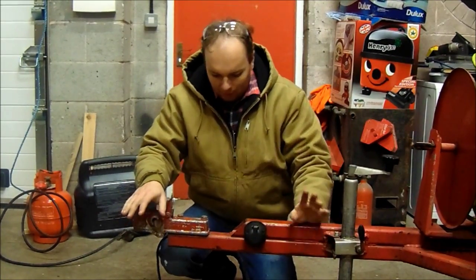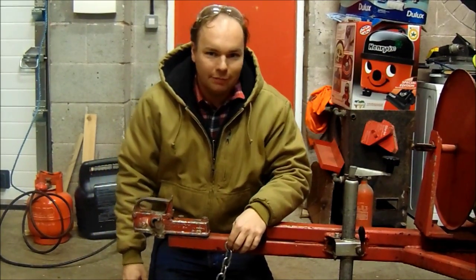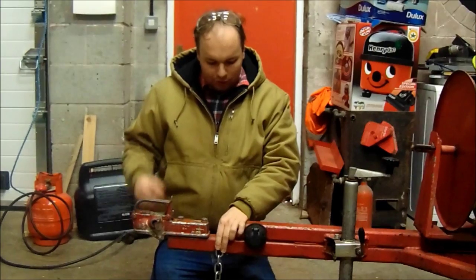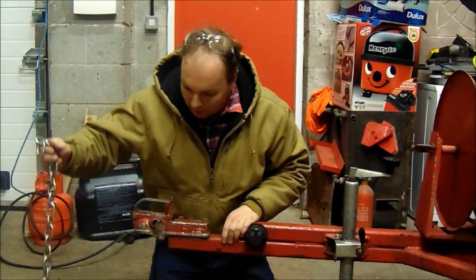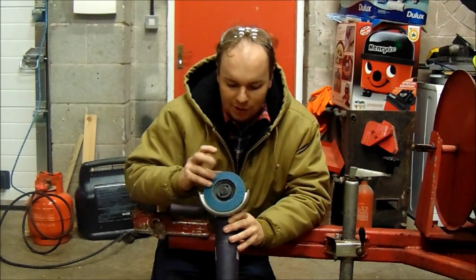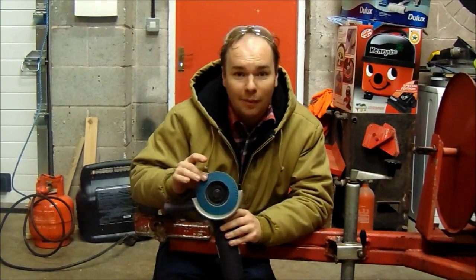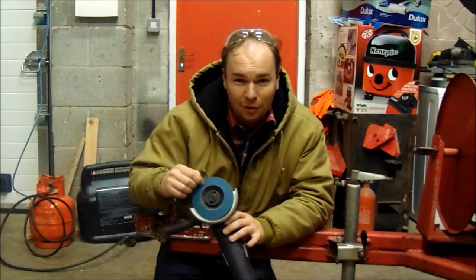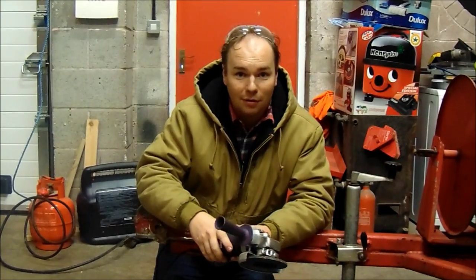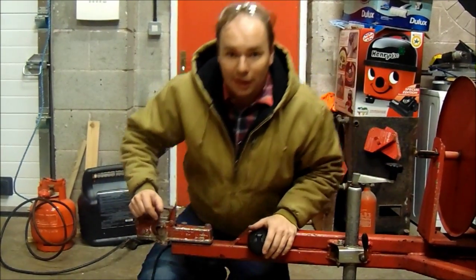We've moved down to the bottom now. This is what we're going to be doing — we've got our length of chain. Looking around the hitch, I don't want to weld it anywhere that's going to be in the way of anything. Before we start welding, what we've got to do is prepare this surface. To do that, we're going to need an angle grinder. We're not using a grinding disc or a cutting disc — this is a flap disc, or flap sanding disc. This one is 80 grit, so 80 grit sandpaper in little flaps. That'll take the paint off really easily. The purpose for taking the paint off is because when you're welding, the object's going to be the earth, the wire coming through the middle of the MIG is going to be the feed. If there's any paint there it's going to insulate, and it'll also contaminate the weld even if you manage to get through it. So you want to get rid of as much of the paint as you can.